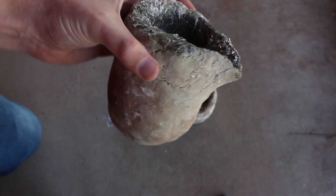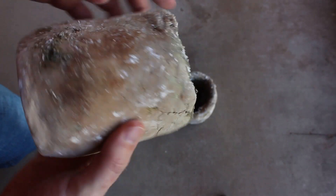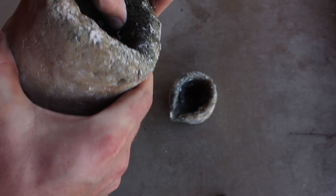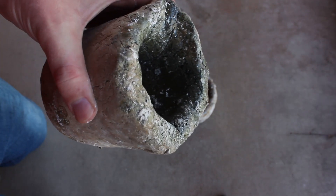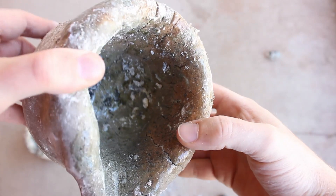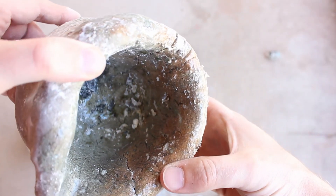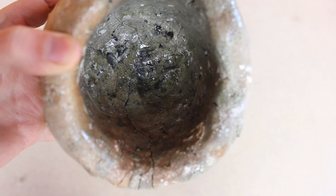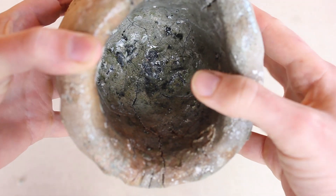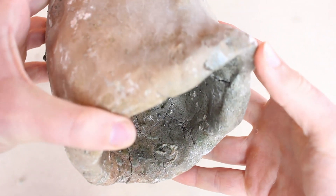And once again, I was actually pretty pleasantly surprised. The borax did form this thin glassy layer over the inside of the crucible, which is what I was hoping would happen. It feels smooth and it seems non-porous. It also colored it slightly green, which I was not expecting, but I'm certainly not unhappy about either. You can see at the bottom there is a slight puddle of melted borax, and that's probably going to cause me some problems later. All the same, I can't help but be excited about this. The cracks and puddles notwithstanding, it looks to me like this is fundamentally going to work, and I cannot wait to try out the actual casting with these crucibles.